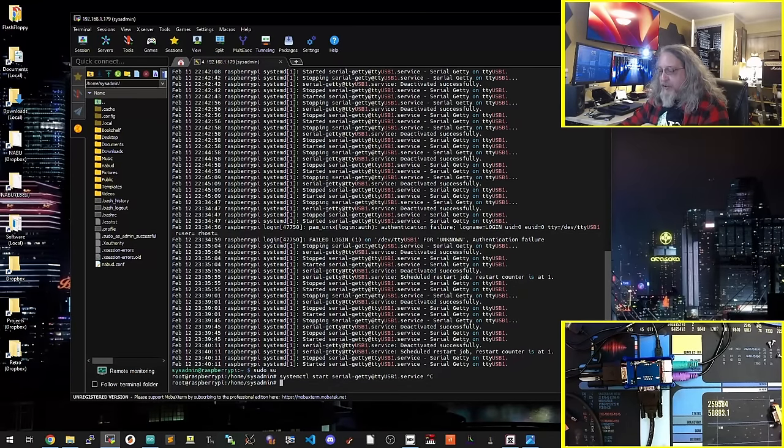I could show what it looks like when it's done wrong. That might be an option. Let me see how I could do that. I could show an example of what TTL and RS-232 should not look like to you. Maybe. We'll see. Well, that's funny. It was broken for so long, I forgot how it was broken. So I was unable to show what it looks like when you have RS-232 and serial TTL hooked up incorrectly. Let's just say, if you verified all your settings and it looks like there's garbage on the screen, you're probably doing it wrong. Wish I could show it. I got a video, but it's not great. Anyways, that's the brief overview of using this as a serial console.